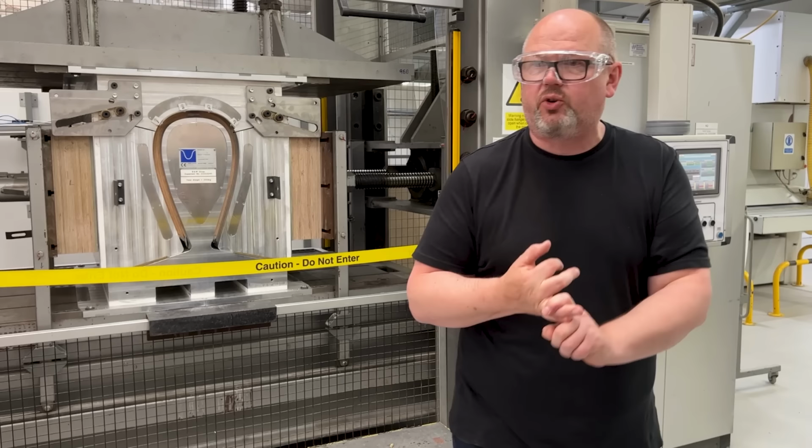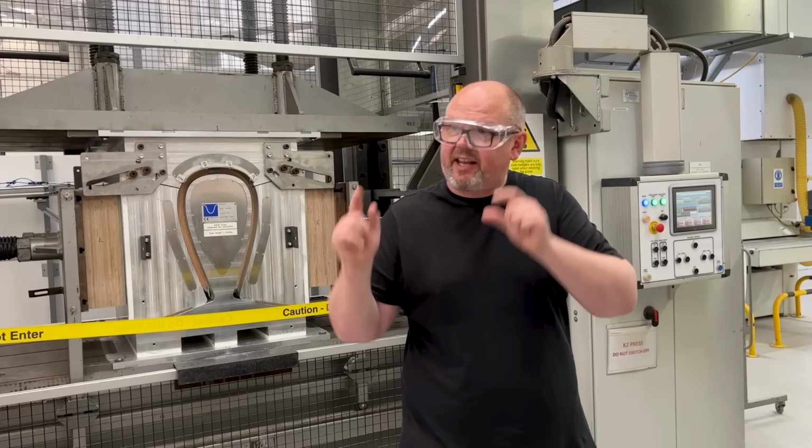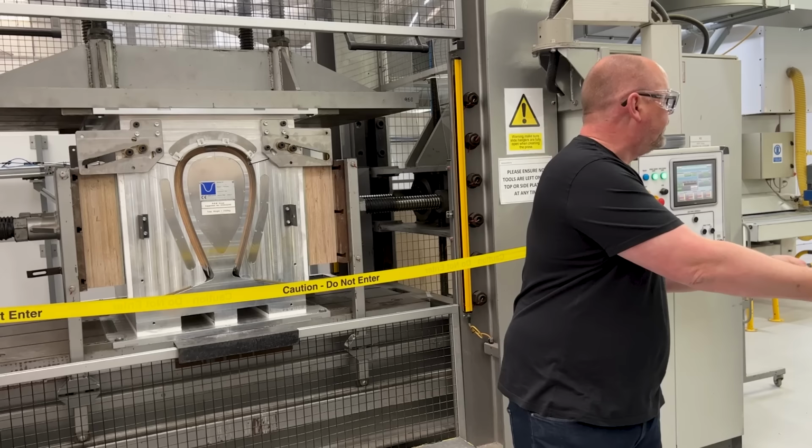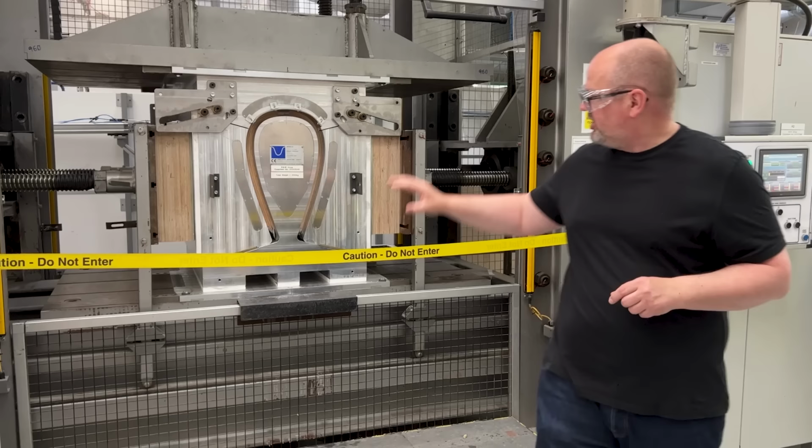This one had to be put in 2015 because we need more power to make the larger cabinets, the 802 and the now 801. The amount of time it will be in there varies with the thickness of the cabinet and therefore the numbers of layers of wood and therefore the numbers of layers of glue. The heat is on those plates over there, you can see the number. The metal is essentially, if you think about it, like a large flat iron. So they're creating heat zones. There's heat at the bottom, at the sides and at the top.